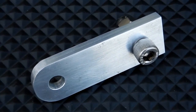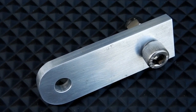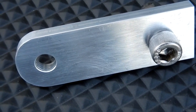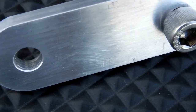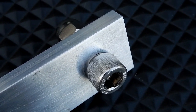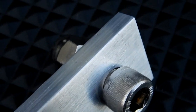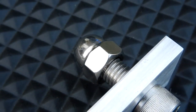These are the extenders that I made. The stock is 4 and one-half inches long overall, by 1 and one-half inches wide, by one-quarter inch thick. I drilled two half-inch diameter holes that are 3 inches on center. To anchor the extension to the turnbuckle end, I'm using a half-inch diameter by 1 and one-half inches long socket head cap screw, and on the other side I've attached a half-inch diameter acorn nut — both stainless steel.